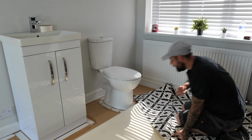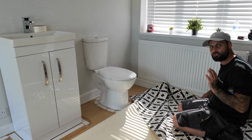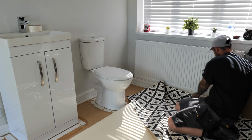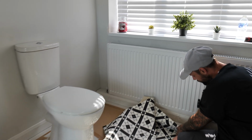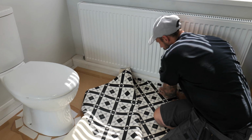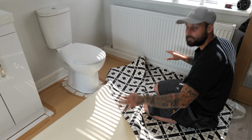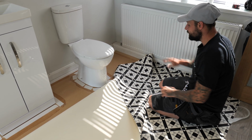Right, so a quick tip. Now that it's straight, pull off any sections of straight wall that the vinyl's sitting against. So we've got this little small section here. We're going to pull that tape off. We're going to unpeel that double-sided anti-slip, like so. And what this is going to do is hold the vinyl in its final position now. So as we're moving around and cutting, we're not going to slide it around and take it out of straight.